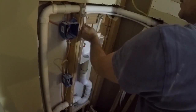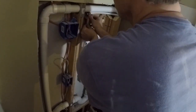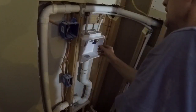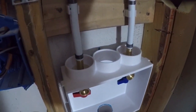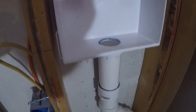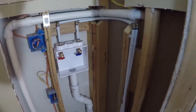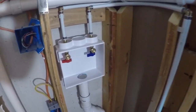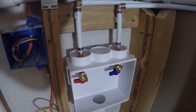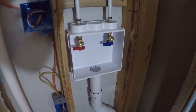Installing the pipe supports so that these stay in a nice fixed position. There's the final plumbing in to our valves. We made the final connections — the box to the PVC drain — and we're good to go. It's not too terribly complicated. You just need to know if your plumbing supply is going to come from the top or from the bottom, and then you can put your box in accordingly.